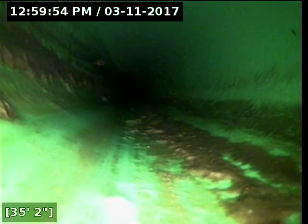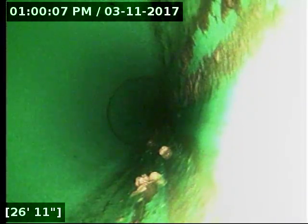I am seeing some grease build up in the line. I don't see any standing water or anything like an underlying culprit that would cause that kind of debris build up, other than the fact that grease will build up in just about any sewer line, no matter how well it functions. You really want to avoid putting that kind of stuff down the line.